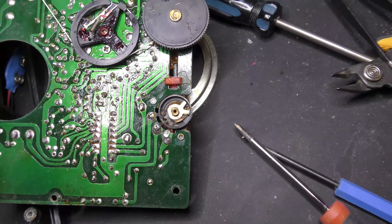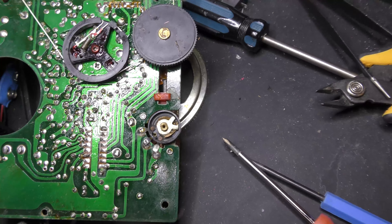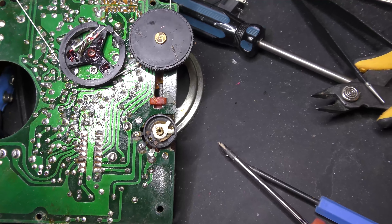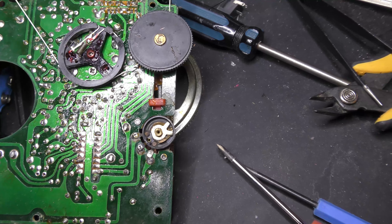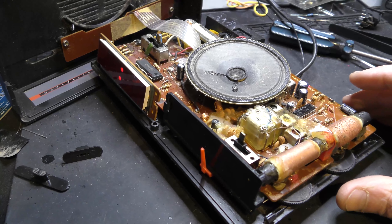The volume control on this sort of radio was really bad also. I've taken the wheel off and you can see the internals now - the tracks are quite dirty, so I'm going to give those a clean up just with a cotton bud and maybe a little bit of alcohol. So there we go, reassembled at least temporarily.